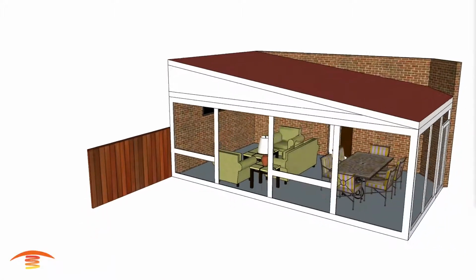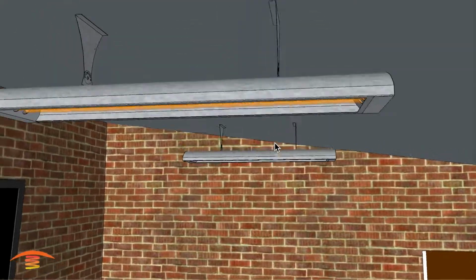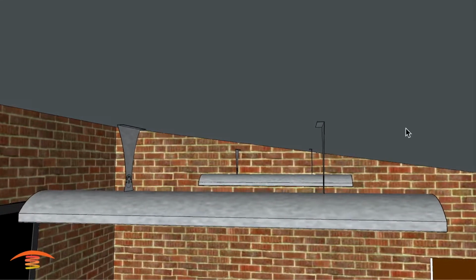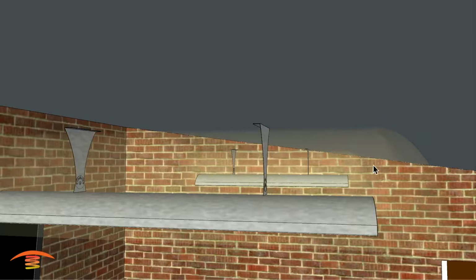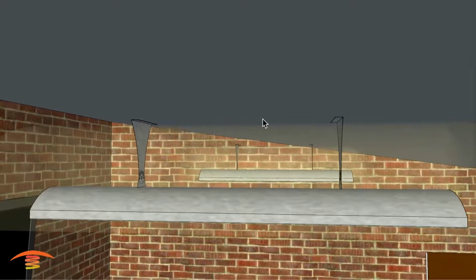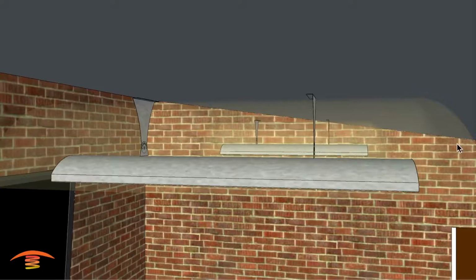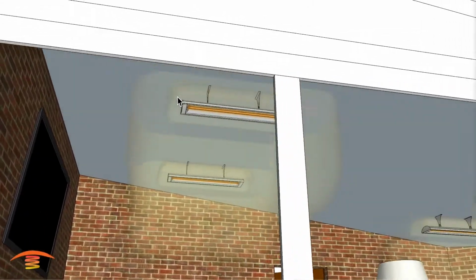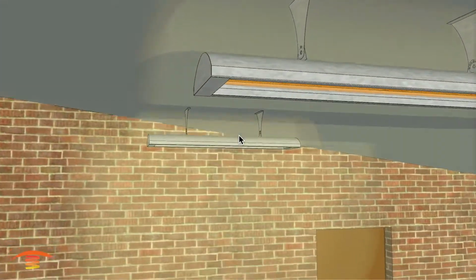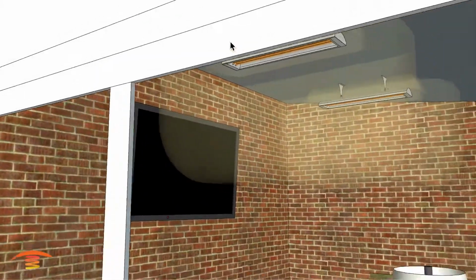All right, so let's go ahead and look at, one other thing I want to mention. When placing a heater, something similar to this, obviously you can see that they're dangling in midair. So the thing is that you do need to meet a clearance above the heater. That heater clearance is 6 inches from this edge to the ceiling, and that's true all the way across. However, with a sloped ceiling, you're going to really work on the downhill side edge to maintain that 6 inches. There is a clearance below that is 18 inches off the bottom edge of the heater. So if we're looking from this point here, from here down is the bottom of the heater, and that's again 18 inches on all 4 sides, and then 36 inches down below.